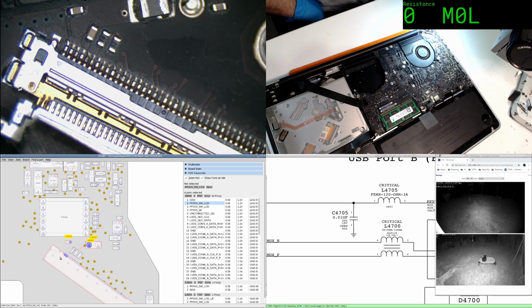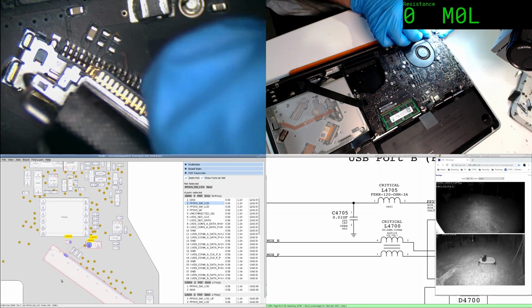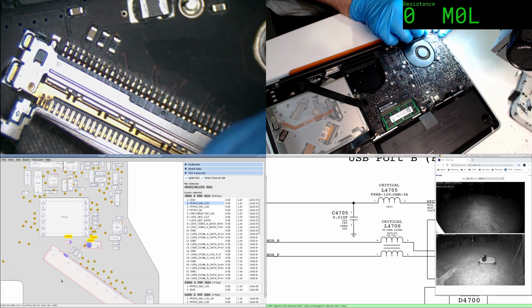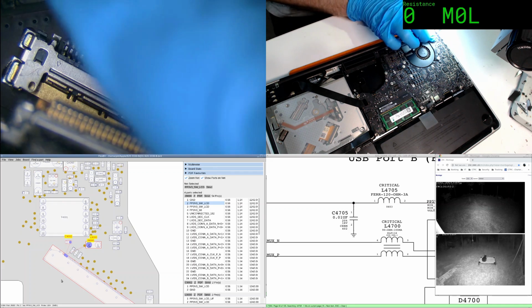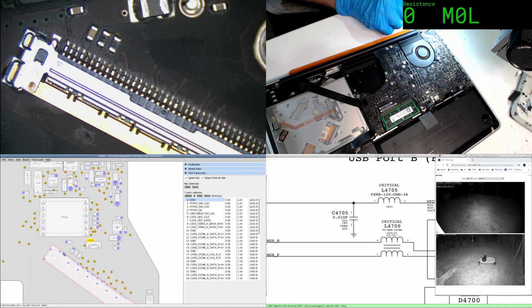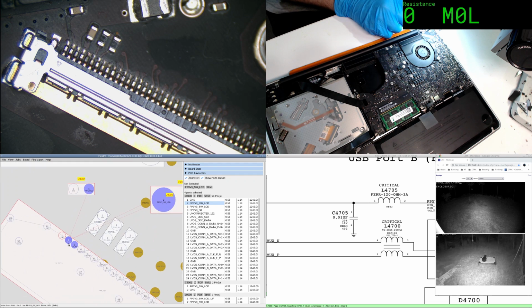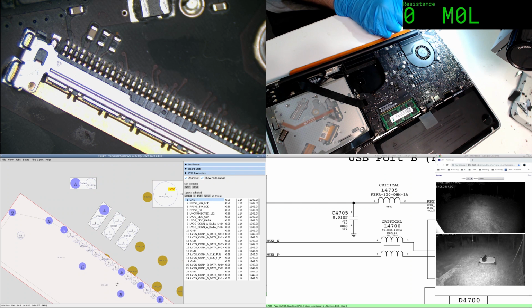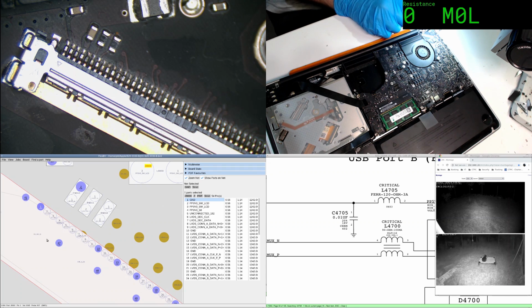Alright, so I'm thinking about what we can do about this couple of pins damaged on the end here. Just taking a look at the connector, just want to verify that I'm not being an idiot much more than usual here. Yeah, it's definitely the first two. If we look at the board view, the first one is ground and the second one is 3v3 for the LCD. Now the 3v3 is duplicated, so we could technically lose one of them. And the ground is spaced out everywhere on there, so again, we could technically drop it out.